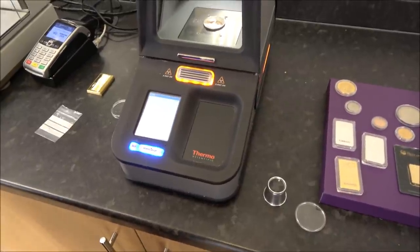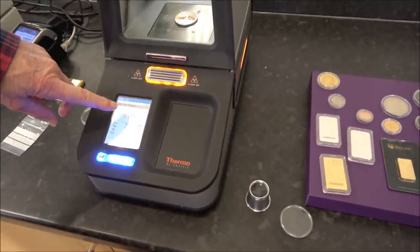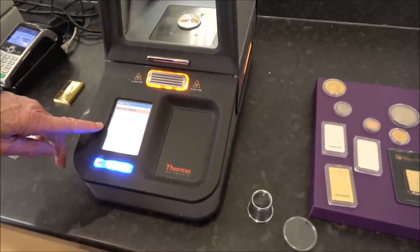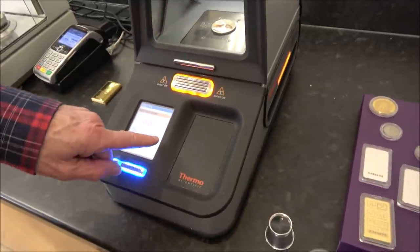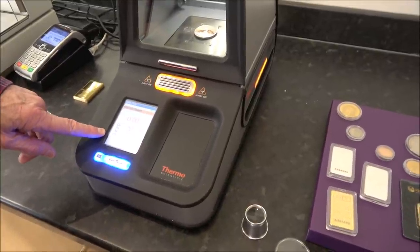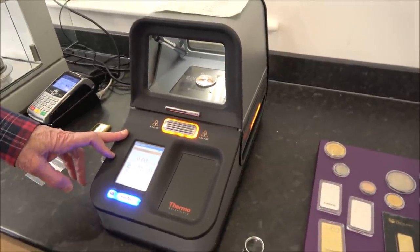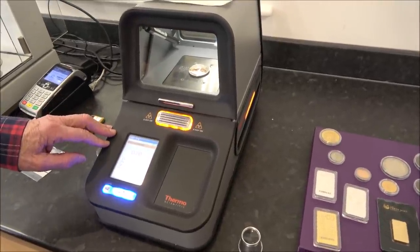It's very magnetic, but we'll see how much iron or if there is any silver. Let's do the clean side — without the coloring on it. We've got an instant display: gold not present, gold not present. There's your millesimal readout. The first four metals it's finding — there's not even any silver-plated content or it's so little it wouldn't register. We've got copper 78.6% plus or minus 0.2%, iron, nickel, cobalt. We've asked for it to run for 60 seconds because that irons out some of the inaccuracies.